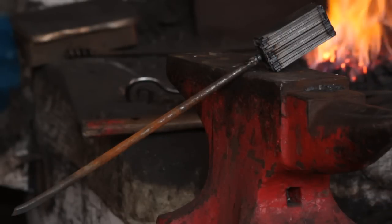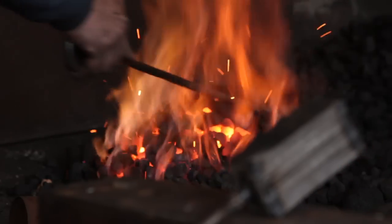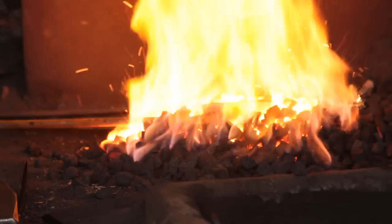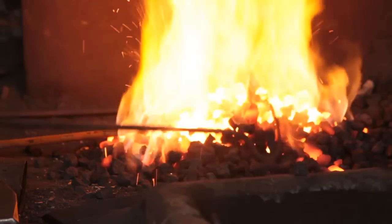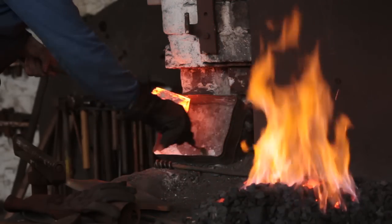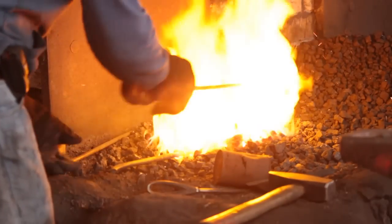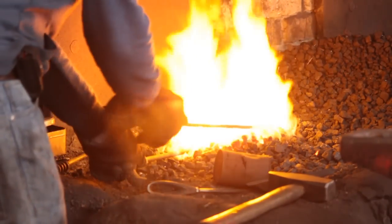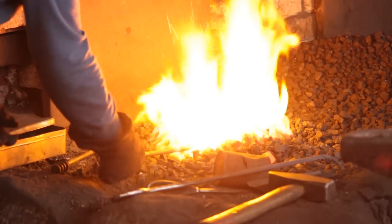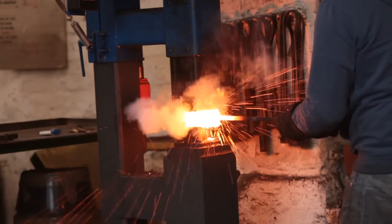At this stage I will pile up my fire to get a nice big neutral layer and lay that in the fire. I'll turn the fire down because I want it to heat up slowly — this isn't one solid piece yet, the outer bars will heat up first and I don't want them to burn before the middle bars have gotten warm. I'll flux quite densely because I'm dealing with carbon steel and it's the first time I'm using 15N20, so that's an extra reason to flux. Back in the fire, I'm rotating the work to heat it up evenly, keeping the coke together with my rake, and then it's off to the power hammer to weld it all together.